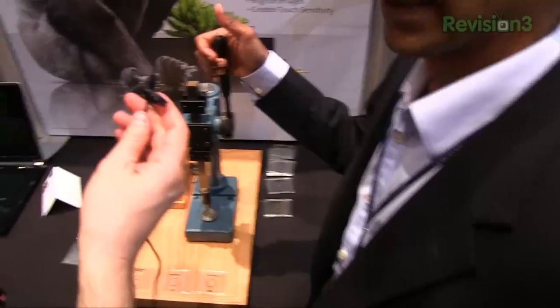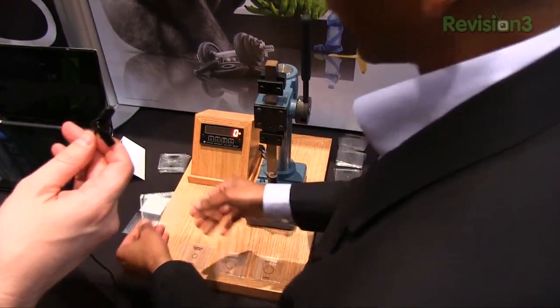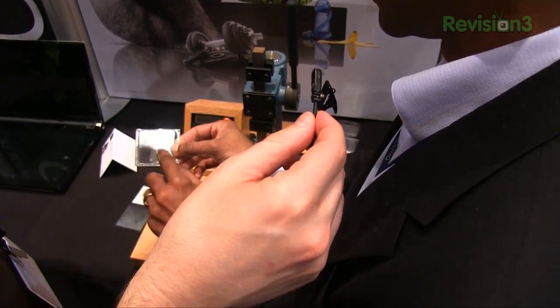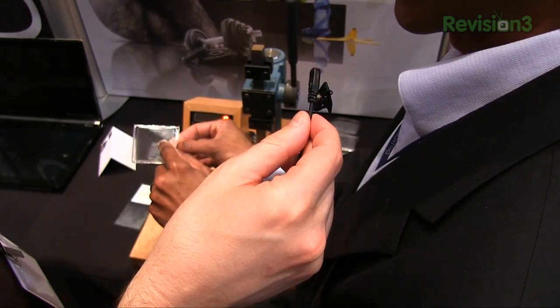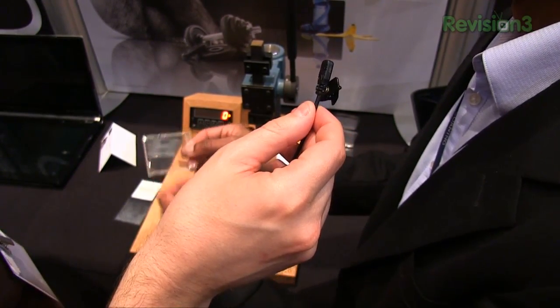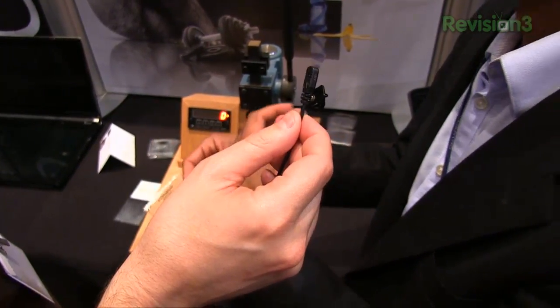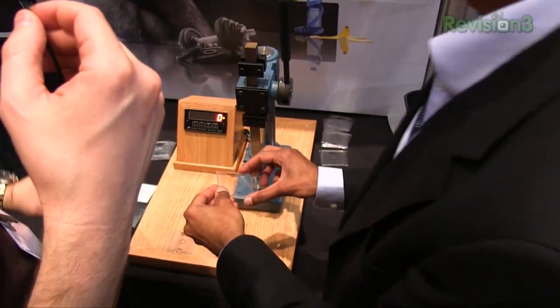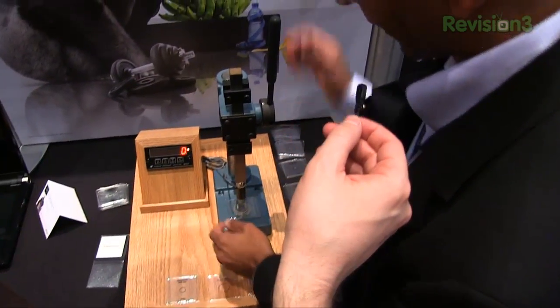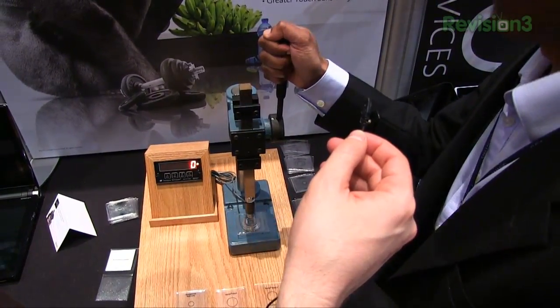What we've got over here is a lever press and we've got four pieces of glass. We'll start with a non-strengthened piece of soda lime glass, one millimeter thick. What we've done is we've abraded the glass, so we've introduced some damage just to simulate field damage — the kind of damage you'd see with a phone being in a purse for a couple of years, or a drop or two. We'll stick that into the lever press and push down to see what load the glass breaks at.